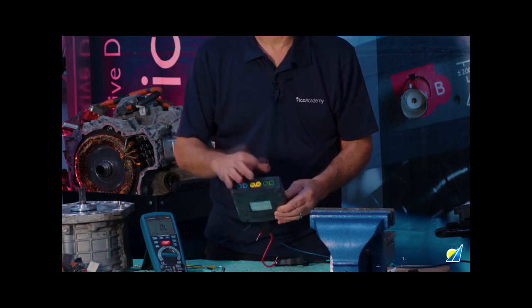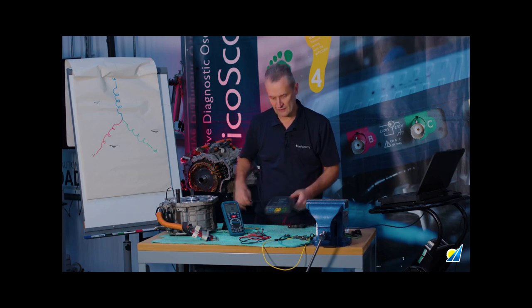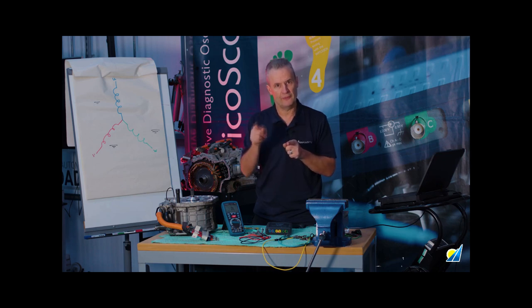The MT03A is a USB device with new software and a unique feature: being able to measure three phases in one measurement using the four-wire Kelvin method. This is completely accurate and allows for any tolerances in the test leads. You're only actually measuring from point of physical contact to point of contact for the resistance value.